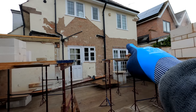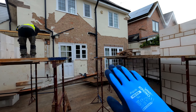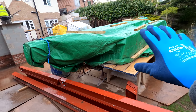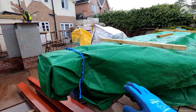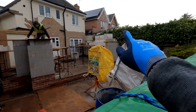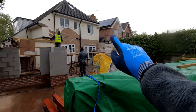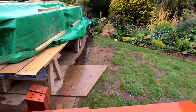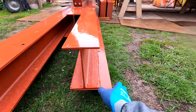There's a column to be where that door is currently so we're going to have to take a section of that out, board it up ready for next to get the block work up in there. Also yesterday, last thing, we've got in our timber — so this under here is all our timber that we need for the roof. We've got some six metre lengths of timber which I'm going to cut down in half for three metres because they're going to do either side for the flat roofs, and then we've got some 3.6 metre timbers here which will be our rafters for our pitch roof.